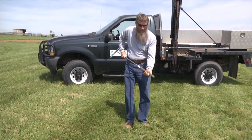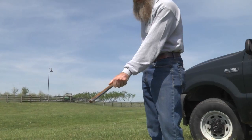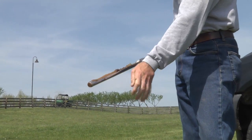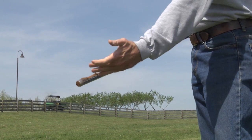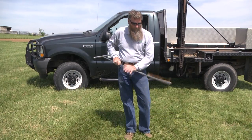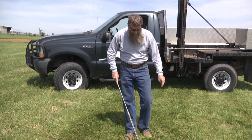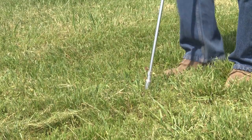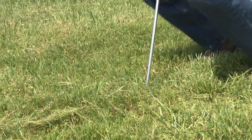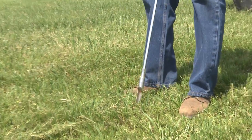What we've got is a hand auger and we can look at the soils and their properties. You can see where the topsoil break is, where it goes from the lighter color to the darker color — there's your topsoil. We just keep pushing this hand auger down into the soil until it gets so dry or we hit bedrock.